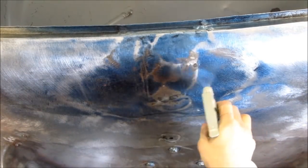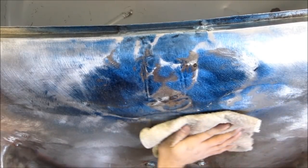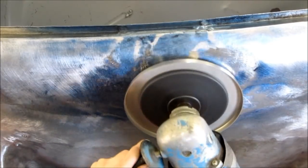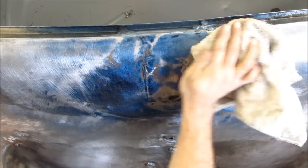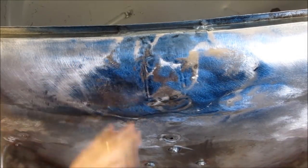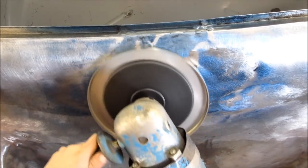You also notice that, with these short passes, we're building some heat quickly and then we're cooling it. You don't want to run over the entire panel for a really long time to where you're heating the entire area all at once, because the metal surrounding the area you're working needs to stay relatively cool, as it is what is containing the heated area's attempted expansion, and therefore that is what gives us the shrinking when we cool it, because it all contracts.